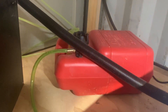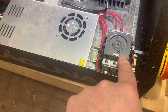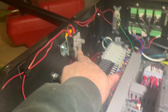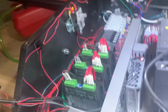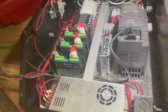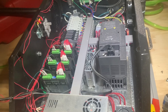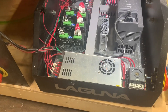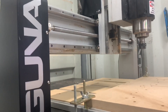Here you can see wires going to a plug — that is the plug that goes to my cooler. Here is the main power that comes from the main switches. When you turn this on it powers this, which powers this. I've got two three-amp slow-blow fuses here. It also feeds my hour meter, so when the switch is on the pump is on and so is the hour meter. Just blow that out now and again when you lube it up. There's not a lot we can do on these IQs — the bigger machines have lubers where you give it a pump every eight or ten hours.